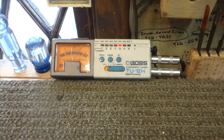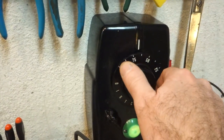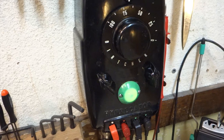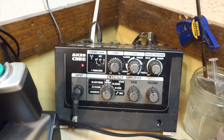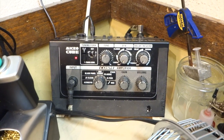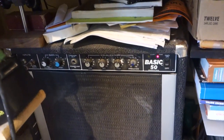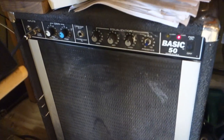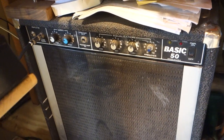This gets rid of any noise when I'm working with electric guitars — and this guitar actually does have a little bit of a problem with it. Position number three, as I switch over here, it turns on the amp. You can see there's our problem. It runs this little Roland Microcube, which I use essentially as a preamp to have something versatile on the bench. But it runs through an old PV bass amp, which is switched on and off by a relay controlled by power from the switch box.